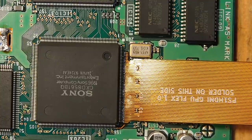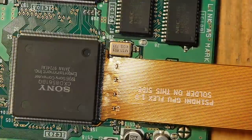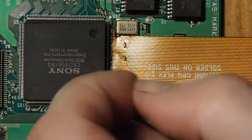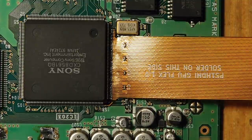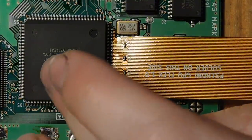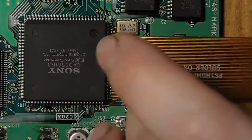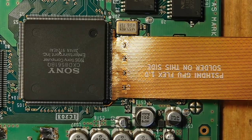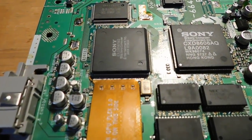At this point most of the pins are soldered, but it's too zoomed out for me to see if there are any bridges. I'll move to the microscope. To summarize the technique: use an up-and-down motion, not side to side — moving side to side can bend or dislodge pins and ruin the chip or flex. Don't put a lot of solder on your tip, use plenty of flux to minimize bridges, and take your time with this — definitely don't rush.